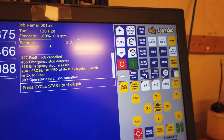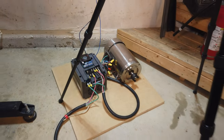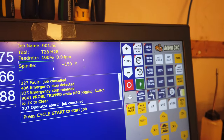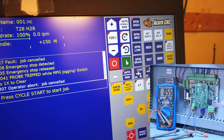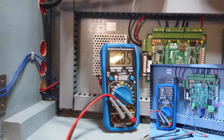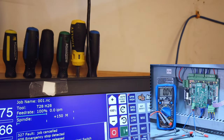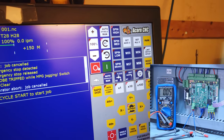The VFD and motor are disconnected from power so we're not going to hear the motor turn on. We got 0.55 volts on the analog pin in manual mode — that didn't do exactly what I was expecting. When we kick it off we get zero. Let's make sure we're on DC. We're on DC, so we're wrong about that one. It did kick the M3 relay on, that's good, but running the spindle at 100% the voltage is jumping a little and it's not right. Let's try running a program and see what happens.